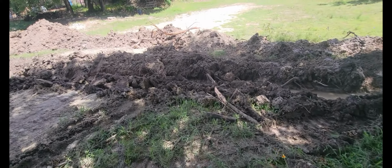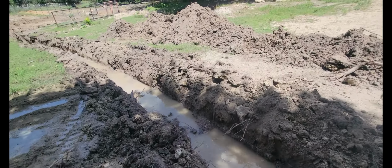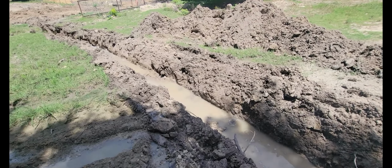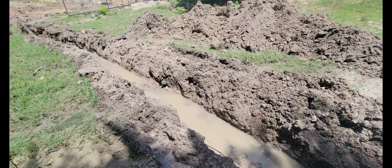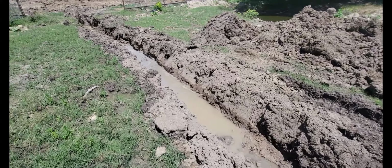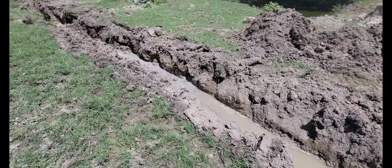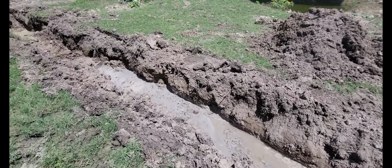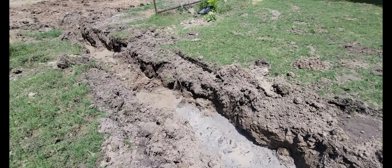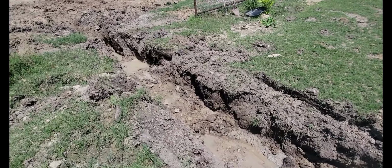But I'm humbled by the amount of water, and it makes me want to rethink everything. You know, there's so much emphasis on leaky weirs and one log dams and rock dams and spreading the water. All that on the surface is one-dimensional. There's so much more happening underground, and I don't think most people understand that. Even highway projects will have gabions in the ditch, stopping the erosion, letting the water slope in. But we're only doing that on the surface.